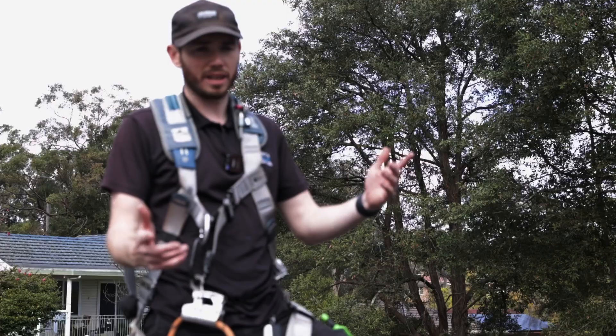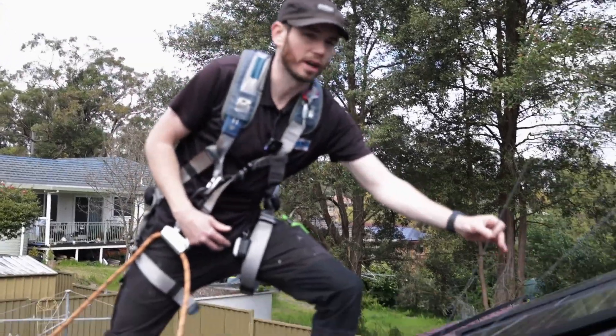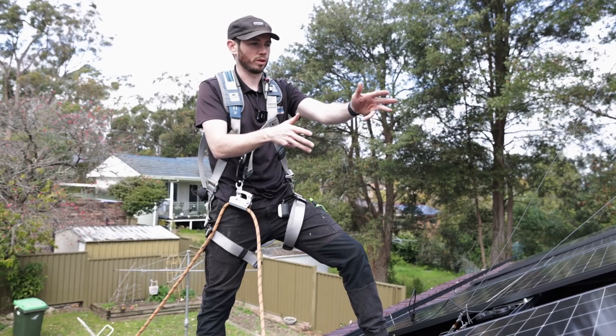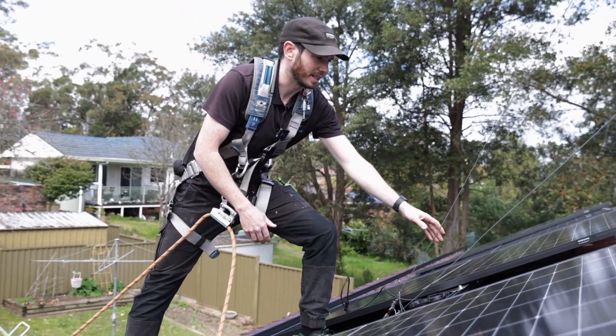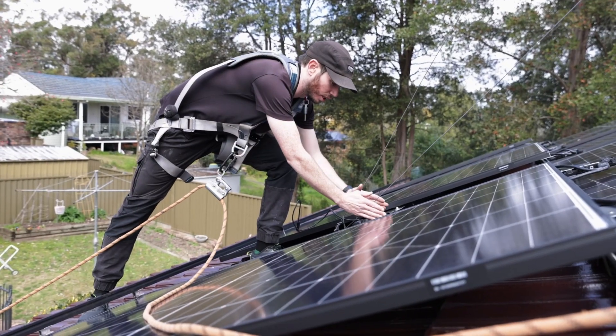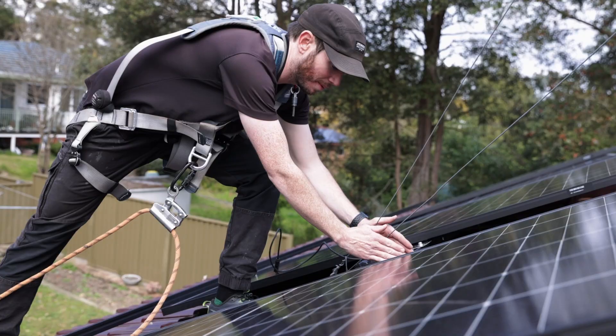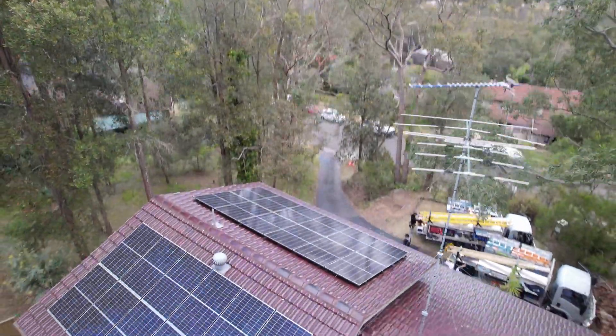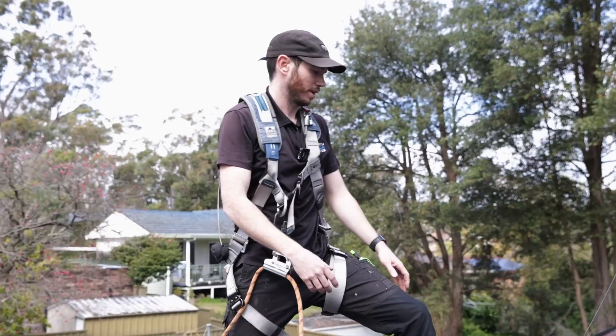When laying these panels today, we've got some aerial guide wires in the way. We measure the first panel so it sits perfectly, with a gap of about 20mm between panels. These cables will sit perfectly in between the two panels without touching, and it can still support the massive aerial. In areas like this where aerials are super high, we need to make sure we keep them on the roof, otherwise they'll just blow over.